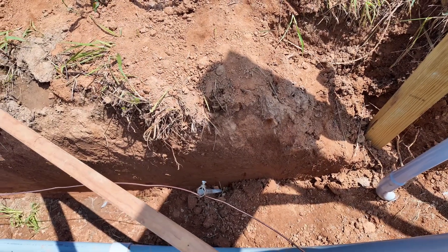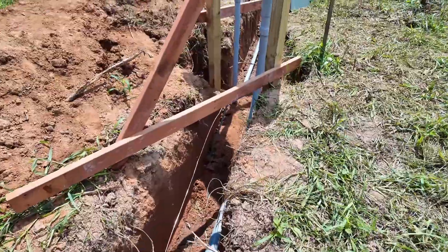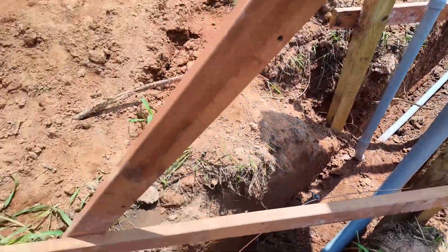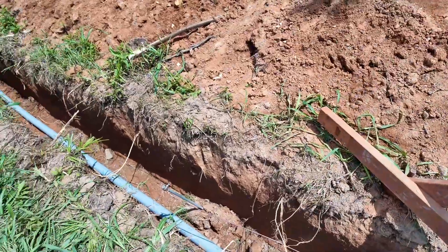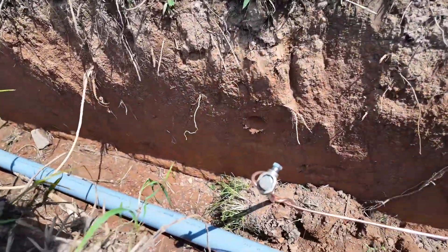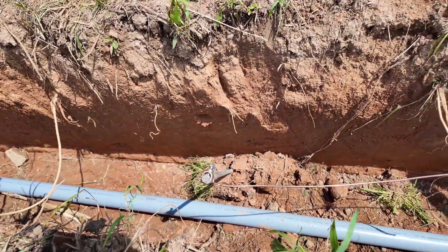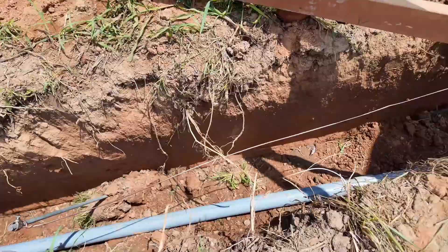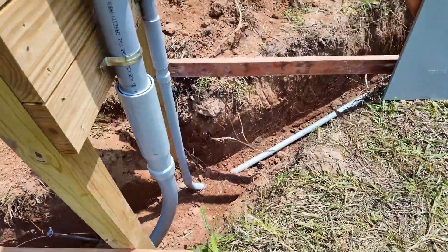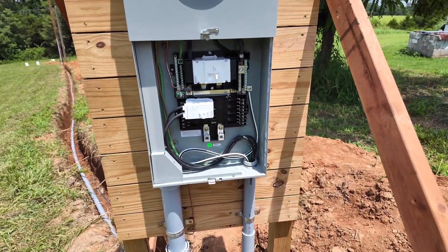What they require here is two feet from the panel box for the first one, and then six-foot spacing to the second one, just below grade a little bit. I got some grounding clamps here — I kind of showed you a close-up. I just wrapped it around there, and I believe it's six gauge copper wire. Your local supply house will know that, but anyway, got that all ran in — should be good to go.